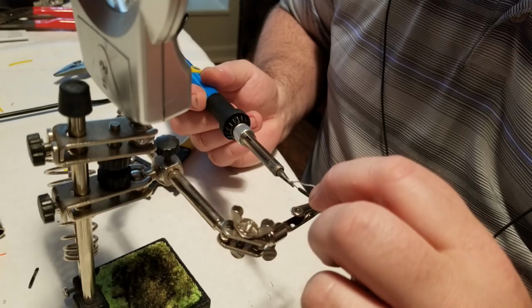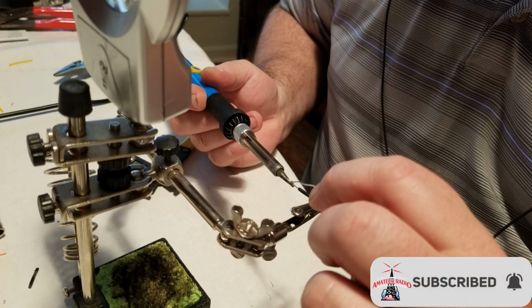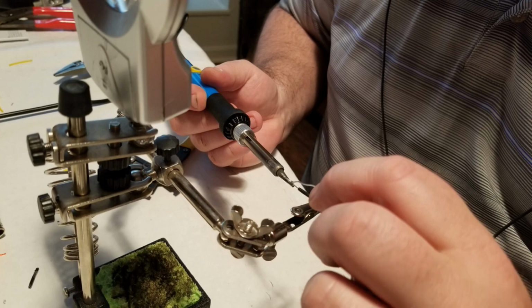Here we can see I'm working on one of the elements. It may be a little tough to see, but I'm working with some of the black wire. You'll see that the black D10 wire is a combination of several strands of copper and a couple of strands of steel in the PVC coating. So it's really quite strong and flexible. So it stands up well and works well even to high wattage. I think Callum's tested that all the way up to 1500 watts or so. So it's a great wire. I believe it has some military ratings to it, at least for the UK system over there.